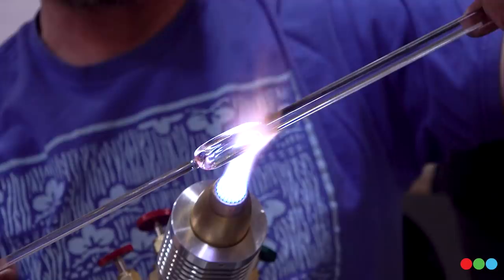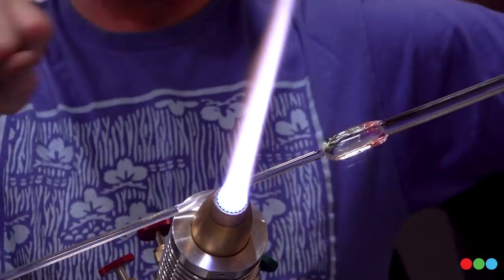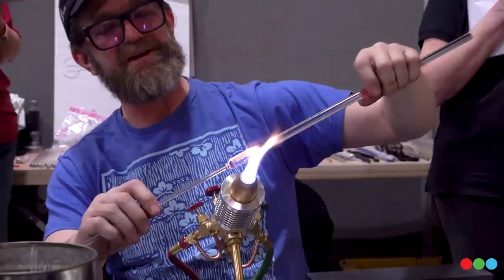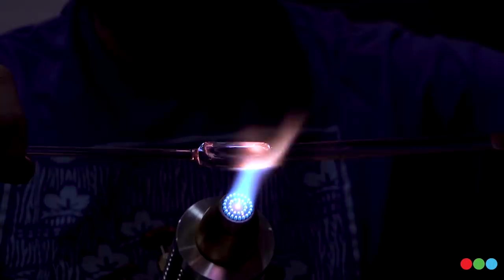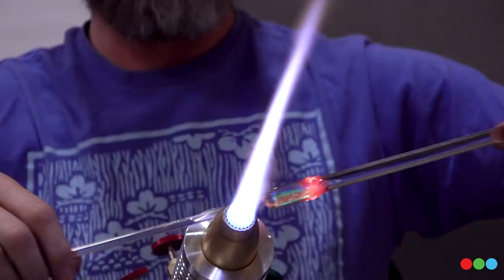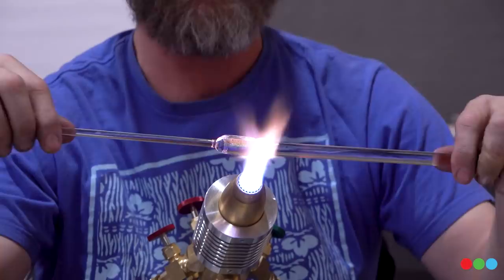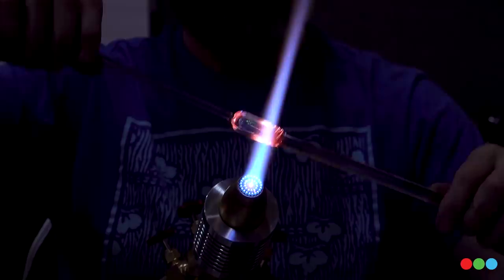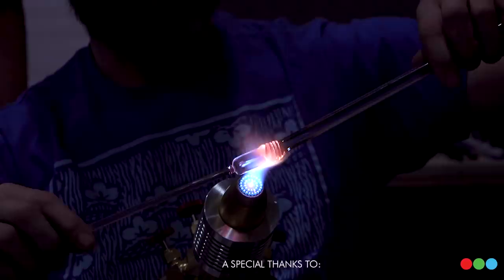As I heat up this little plug of glass at the back, I'm really just going to focus on getting the top 25 to 30% hot. You've got to keep your arms together — don't let your hands drift out or stretch. I get that hot, then I do my twisting outside the flame: come out, little nudge, nudge — that's all, just that small. Then when I go back in, the little ropiness I did create starts to resolve and melt in. You don't want big ropy high and low points because those high points will sometimes melt in and create bubbles. By doing this in small staggered steps, you resolve all the ropiness.